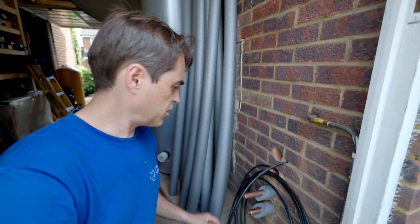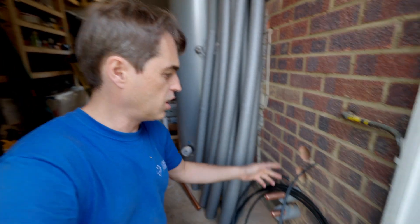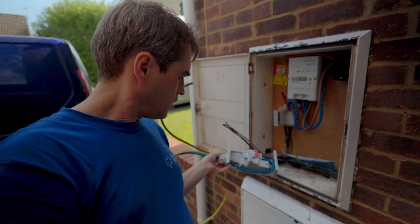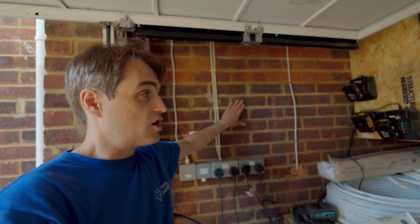As always, we're using Primary Pro insulation for the pipework, nicely mitred so it looks very professional. A 2.5mm high-tough cable goes to a new fuse board I'm yet to install in the garage. Inside the garage, this is our flow and return entering. That armored cable runs inside the cavity - really neatly through the wall - and comes out in the garage. The new board will go right here, supplying power to the controls and to the heat pump.